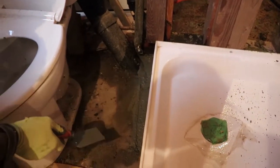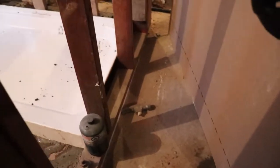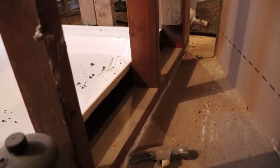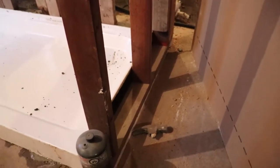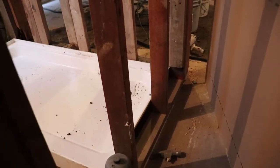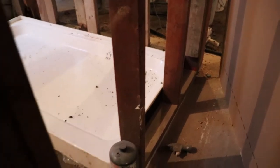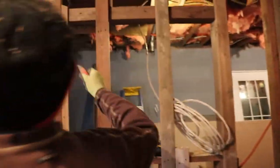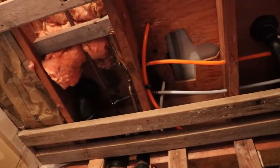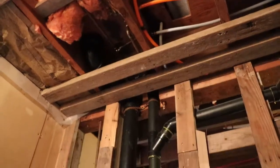The concrete just ran from there and came out here. I'm still gonna mix a little bit more and try to push a little bit more in here underneath it to give as much support as I can. I'm just gonna come from the back there and push some more concrete in because I want this shower base to be sitting nice and flat on the concrete — that way it doesn't make a squeak sound when somebody's having a shower in it. This works very good. I'm gonna mix another bucket and try to push it in as much as I can. I'm just gonna use foam from down here and spray it right in — that will do the job.